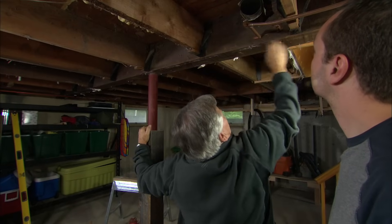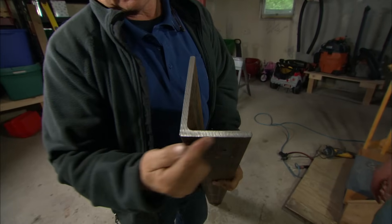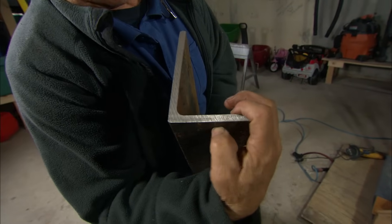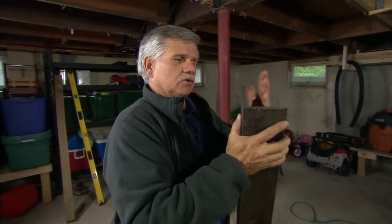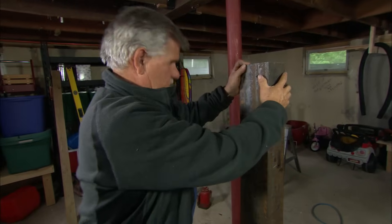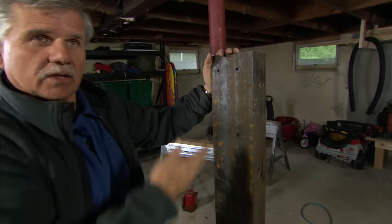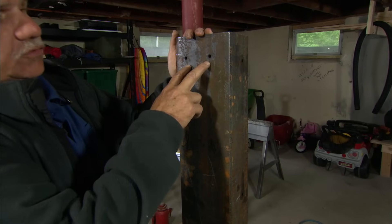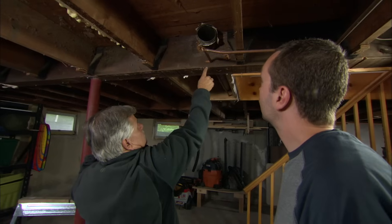Now we're getting ready to repair your damaged beam. To do that, I'm going to use this piece of angle iron — it has a four-inch leg and a six-inch leg, and it's three-eighths of an inch thick, so it's good and heavy. This will more than make up for the damage done to your beam. I want to sister this side of it right against the side of your beam. I found this at a metal shop — anybody can go to a welder shop or metal shop and order any kind of steel they want. I ordered one the length I need and had them drill holes so we can fasten it to the side of your beam, including a large hole for your copper water line that runs through the beam.